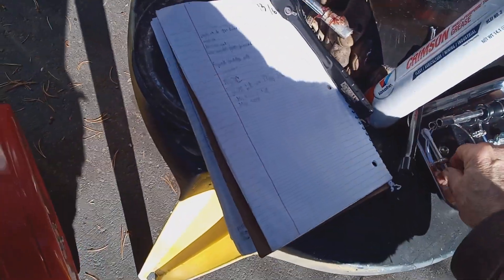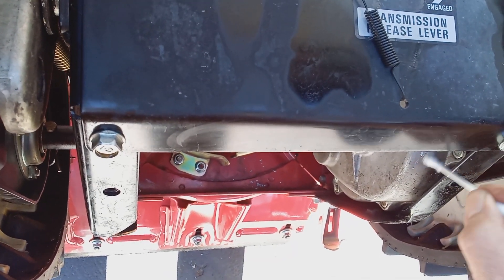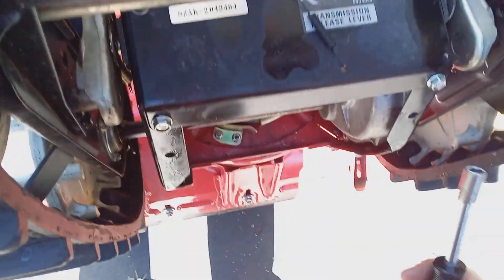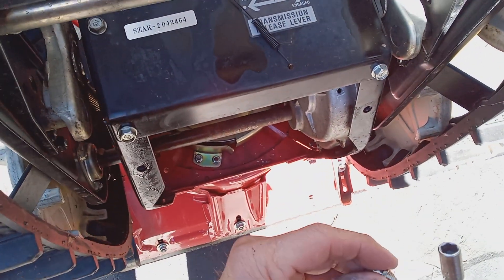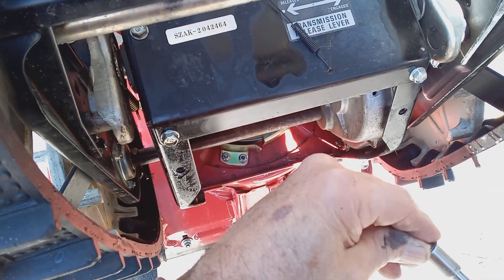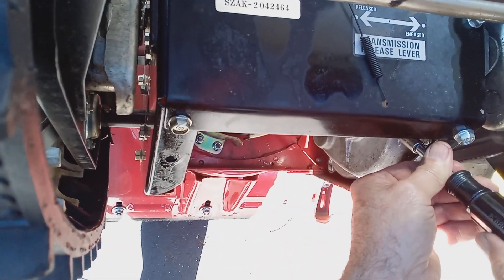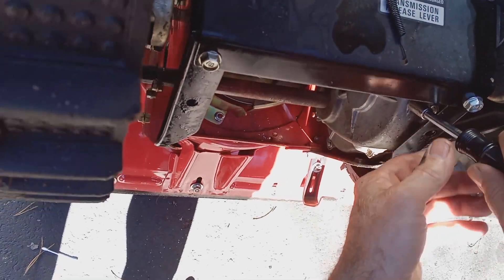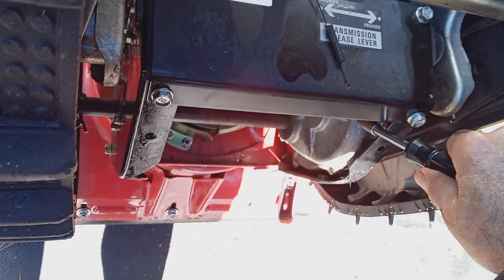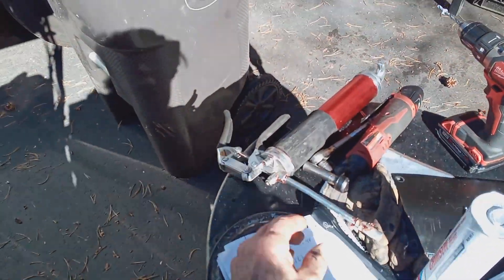The only thing stopping most people is having the right tools. Go in there with the Q-tip again to clean it out. Now I've got my 8mm head socket for this M6 zerk — it fits right in. I'll tighten it in there nice and easily. You don't want to make it too tight because you might mess up the thread, so you want it snug — just a little bit more than snug.